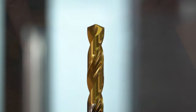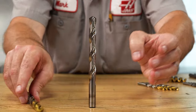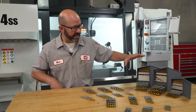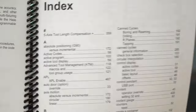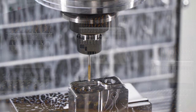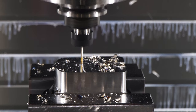For general CNC work, I'd rather have a 135-degree tip angle drill than the 118-degree drills we used to use. They perform better on steels, they're less likely to walk on us, they enter and exit the material more easily, and this adds up to more accurate holes with fewer burrs. We call these drill indexes because they keep all of our drills in alphanumeric order so we can find them quickly. This kit includes our full fractional, number, and letter drill indexes, along with backups for our most used sizes, like those diameters we will be using as tap drills.